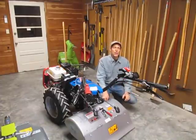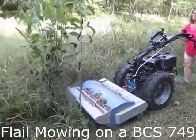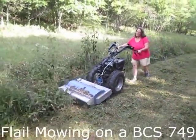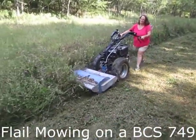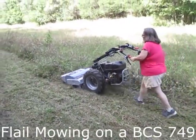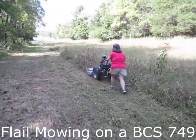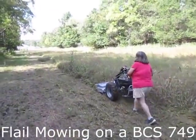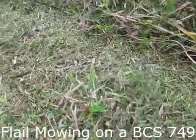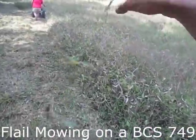Now we'll get into mowing. The most popular mower by far for the walk-behind tractor is the flail mower for agricultural use — perfect for cover crop integration and mowing old vegetable crops into almost unrecognizable mulch. Anything you want to mow up to a three-quarter inch sapling is pulverized when the flail mower passes over it. With a horizontally-mounted drum with numerous swinging blades, flail mowers are like a moving chipper shredder that completely annihilates everything in its path, leaving material 2 to 6 inches long depending on whether you have the removable discharge baffle installed. That feature is only available on the Berta brand flail mowers, which are our most popular machines.